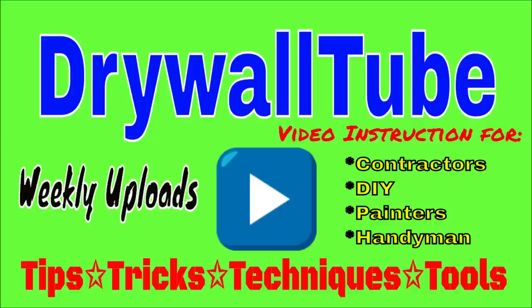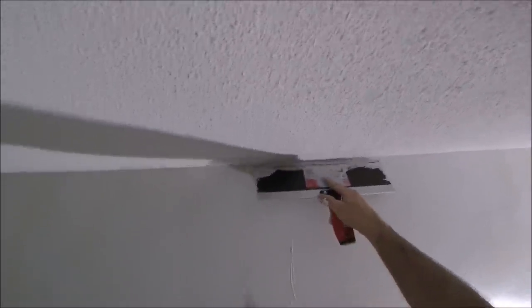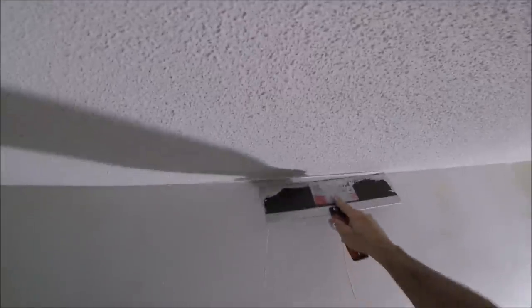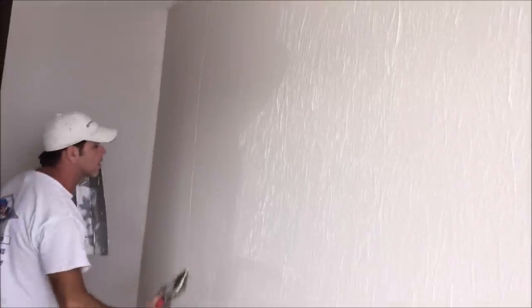Welcome back to the channel. In today's video, I'm going to show you how to cover up your ugly damaged wall in less than 30 minutes with a skim coat. I'll be using a 14-inch blue steel drywall taping knife, a 16-inch stainless steel mud pan, and some thinned down USG all-purpose joint compound. This skim coating process can turn your walls from drab to fab. If you stick around to the end of the video, I'm going to show you a skim coating trick you're not going to want to miss using a paint roller.